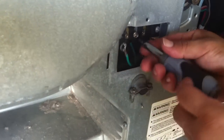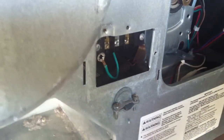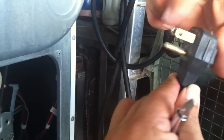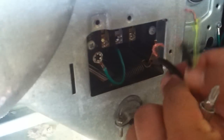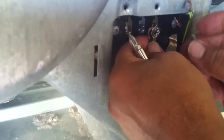The original ground you need to disconnect it completely, and then you're going to connect it to your neutral or white, which is in the middle. On your cord you'll see they have a long prong and a short one — the long one is the neutral. So you follow the neutral all the way to the end. This is very important to do.